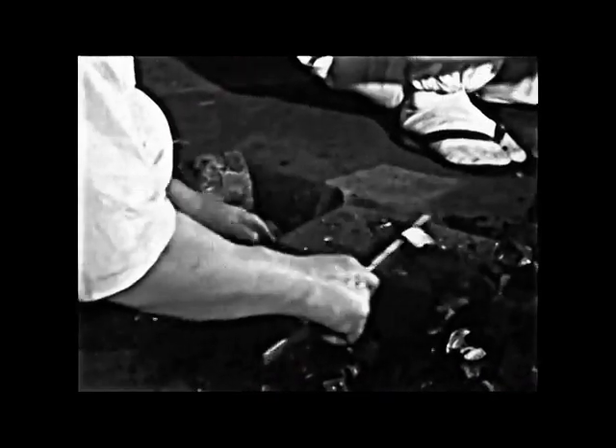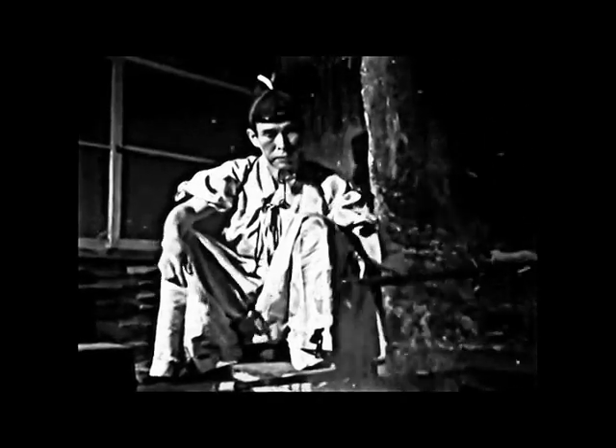The charcoal used in tempering will be cut much smaller than that used for the other processes. It requires three years of training for an apprentice smith to learn just this seemingly simple charcoal cutting process. Quick and nimble hands are needed for this job and an even quicker eye. The moment of truth for this particular blade is moving ever closer. The tension seems to rise in direct proportion to the heat from the new fire. Traditionally the final tempering is done at midnight — based on the sound scientific rule that one of the best ways to judge when steel is ready for tempering is by its color when seen in complete darkness. As the fateful moment approaches, the only sounds heard are the snap of the fire and the sigh of the bellows.